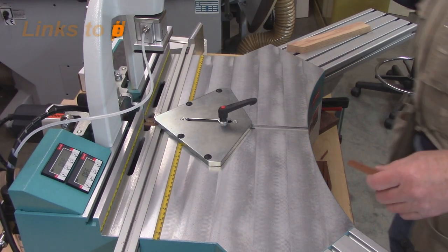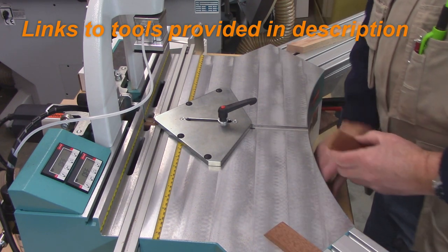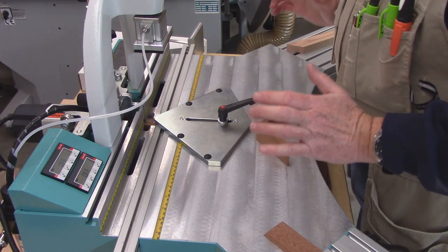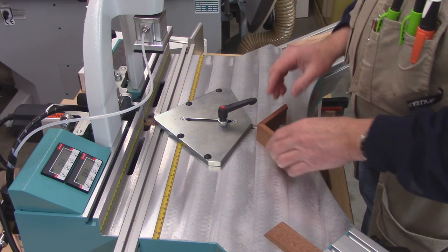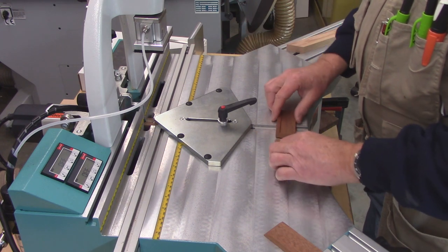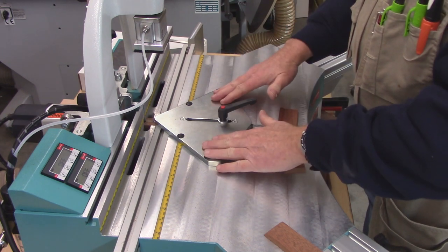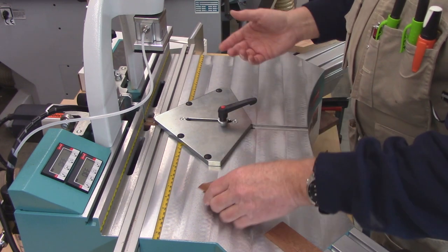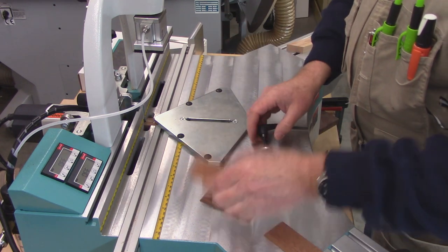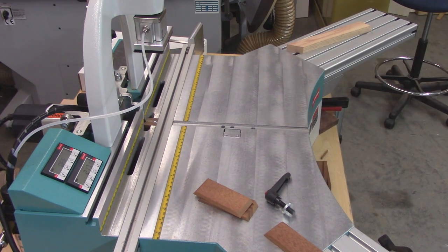Okay, I'm going to use the Hoffman MU3 dovetail machine to do the joinery on the shadow box. This is already set up with the W0 bit from the last videos, and I'll be using the same bit to join this five-sided miter box. Now, this is the standard fence that comes with it. It's for 45-degree miters. But obviously that isn't going to work for a 36-degree miter. So I'm going to remove this.